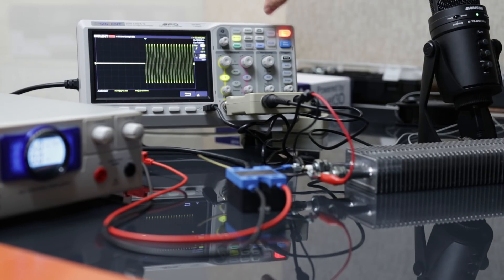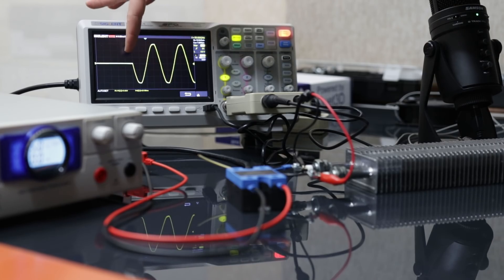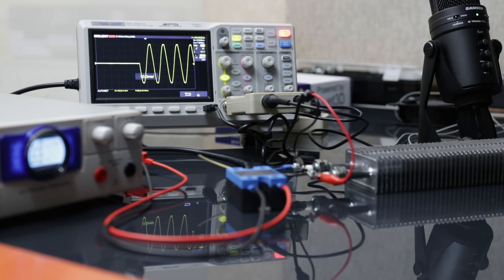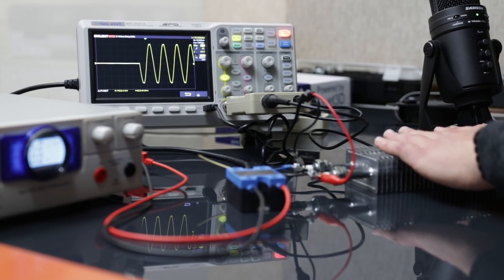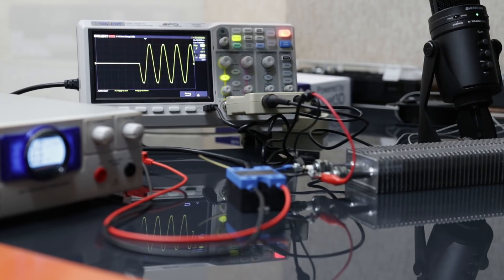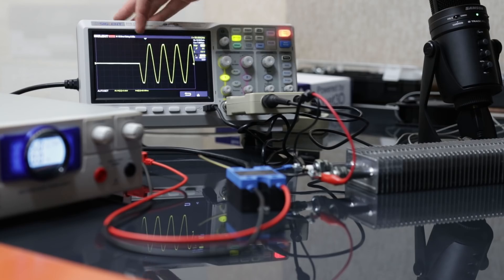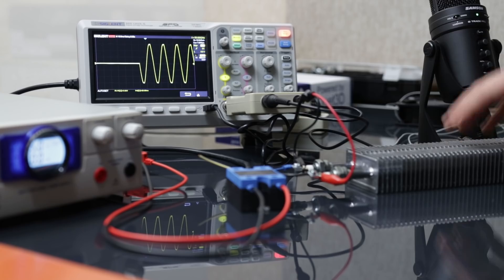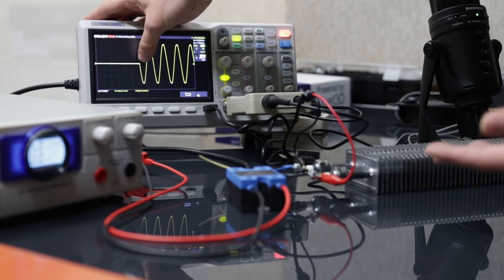Because it's a zero crossing relay, it always goes on when this sine wave is going through zero - and that's why it's called zero crossing. And it has an advantage, especially when this 1 kilowatt heater is heating up. When a regular switch is switching at some random point and it switches at the top, a full current rush is running through there and that causes a lot more stress - you can see lights dimming. But at this exact zero crossing moment, there isn't any current running.